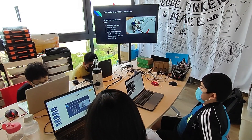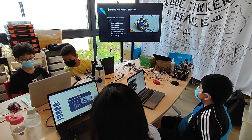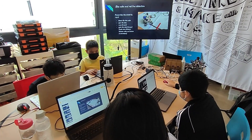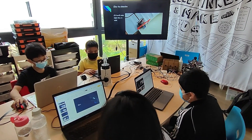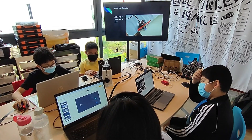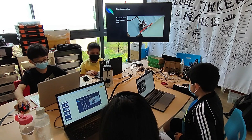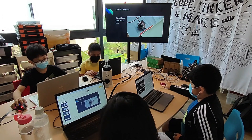Now we are talking about blue cube detection. We get percentage blue by dividing blue by R plus G plus B. When we detect the blue cube, we open the claw, move forward, and push the cube forward to make sure the distance between the cube and the colour sensor is consistent. We do the same thing with the red line but using percentage red. We need to detect the silver strip to start the evacuation zone code. Since the silver strip is more reflective, we detect it by checking that the red, green, and blue values the robot is reading are higher than the values for white. The white values are already stored in a list which we use for the calibration function.